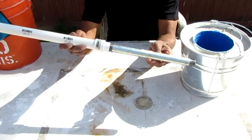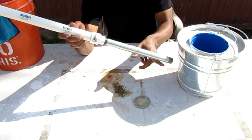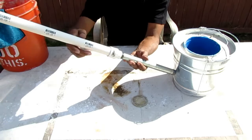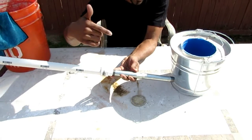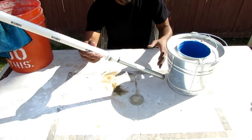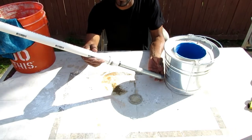I'm simply going to screw all that together, then drill a hole into the bucket through the plaster of Paris and sand mixture, coming in at an angle. This is where I'll introduce cool air from a safe distance into the mini foundry, which will make the heat tremendously hotter — and it'll be at a safe distance.